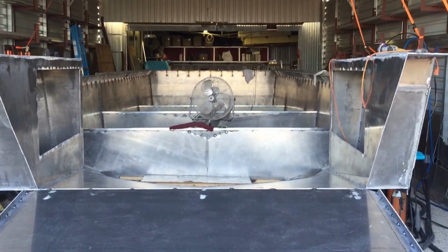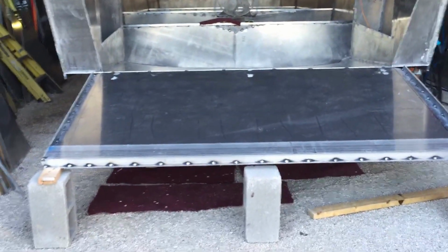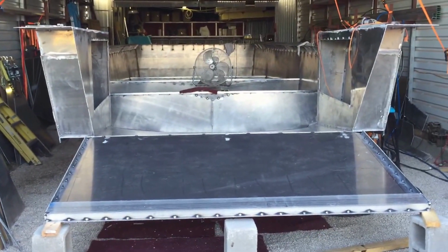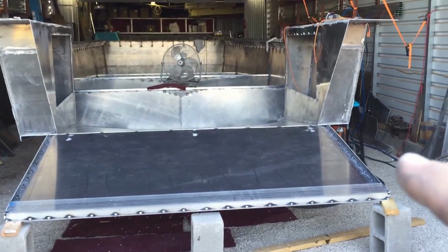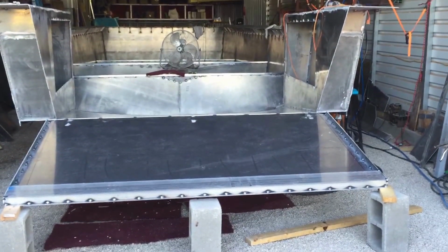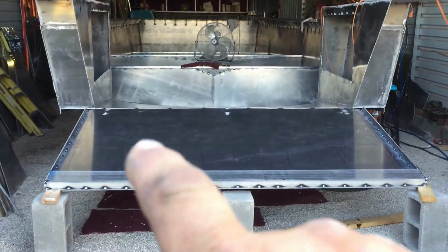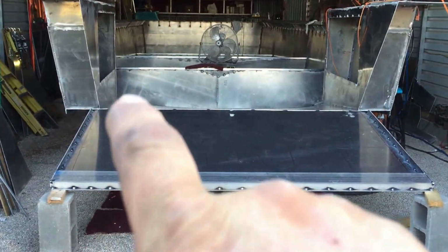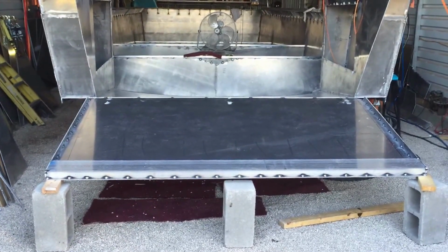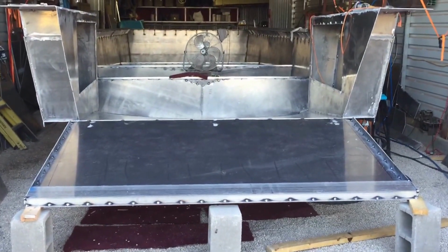But I really like this front door. Pretty cool. Turned out super good for doing this by myself today. I'm super happy with it. And by putting that edge on there, that flat bar standing on edge, it's already trying to keep its shape. I'm trying to keep it from warping out. And like I said, I'll probably have 1, 2, 3, 4, 5 more pieces of this 2x6 going this way. And then I'll just tack weld that stuff on for right now, and I won't have to worry about this front door bowing on me or getting out of shape.